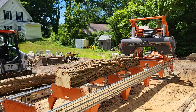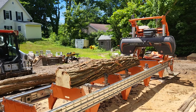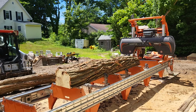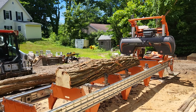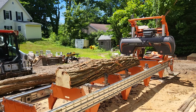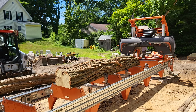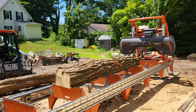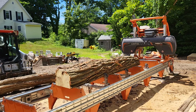and that is 4 slabs, 3 cuts, 3 kerfs. Set my 8/4 scale there. And what that does is that makes my final cut at 2 inches. So we get 2-inch slabs. So we're going to take our top cut at 8 3/8.